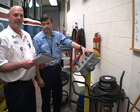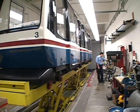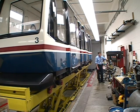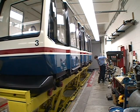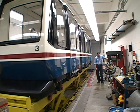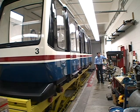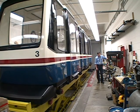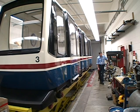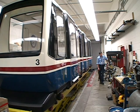These mechanical aids that are in place here at the Senate can be dangerous when an untrained or improperly trained person is using the equipment. On lifts such as these, it is important to be sure to use pins or other methods to lock out the hydraulics.